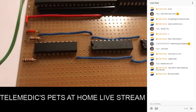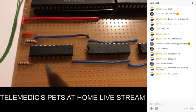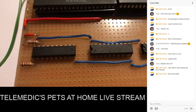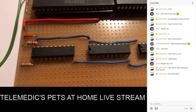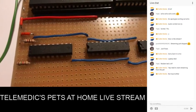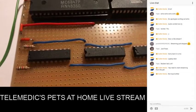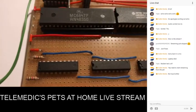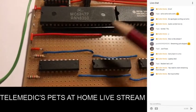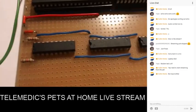So that's that. We have here 3 devices which are going to allow or not allow the CPU bus to talk to it directly. These are 74LS245s. These can be tri-stated, which of course means that they won't exist on the CPU bus once the data is sent, and that allows this device here to continue writing to and reading from its RAM and displaying it out of the video socket. So that's how that's going to work.